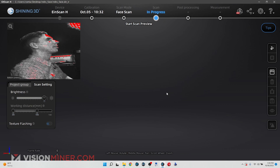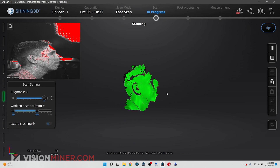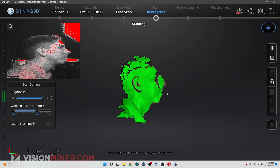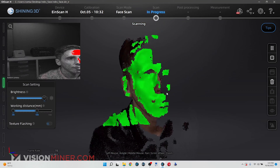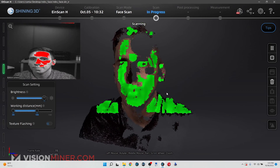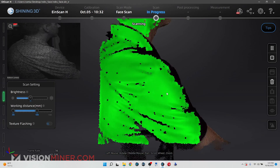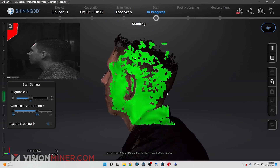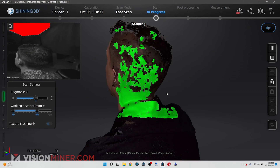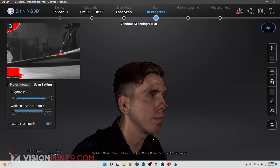Click once on the scanner to start the scan. In the scan view preview mode we can see all the measurements the scanner is taking, and once I get a lot of that green data I can start the scan. You can also zoom in on the subject or zoom out. I'm just going to run through the face very quickly while adjusting brightness. Comparing it to the EinStar, you can see I'm able to capture a lot more area within the scan frame, so the scan is a lot quicker. I can also capture hair as well — slowly go up over the head, and just like that, we're finished.